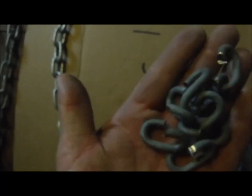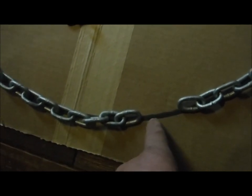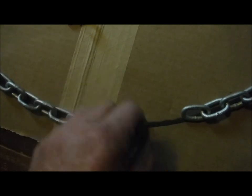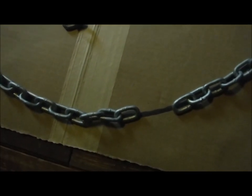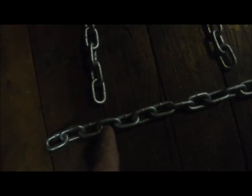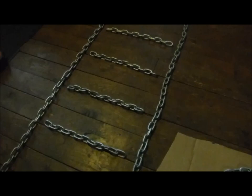Being that I needed 11 pieces, that's 22 of these joining links I need. Keep in mind that for the 25-inch circumference you also need to leave a little room for whatever coupler is going to link the two ends together — that's why you see this gap here. All the cross pieces are spaced out but not yet joined. It's important to count the links carefully and space each one accordingly, doing the same on the other side all the way around.